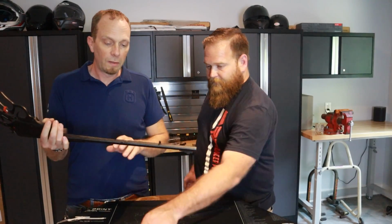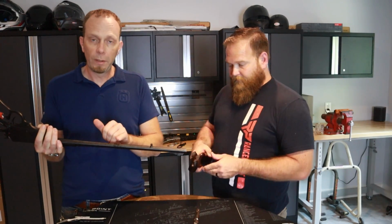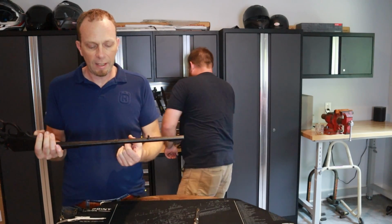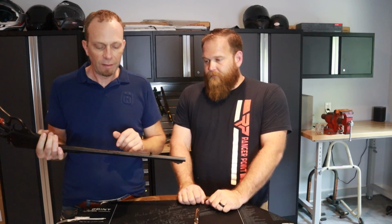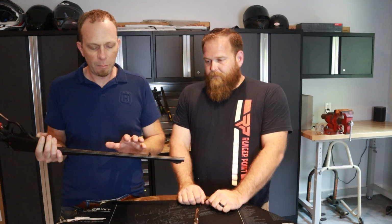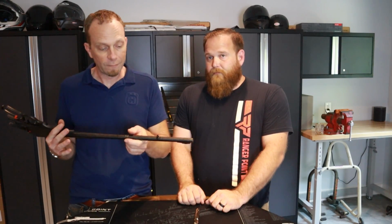One thing that we noticed immediately is that Rossi is actually putting a little laser spot weld on the fore-end tenon. And that's just to keep that thing secure, keep it from sliding side to side. In the past, other manufacturers have used staking and or just tight fits. The laser weld thing came as a bit of a surprise to me, but as it turns out, it's easy enough to break that weld if you want to change out to accessories like the ones that we offer.